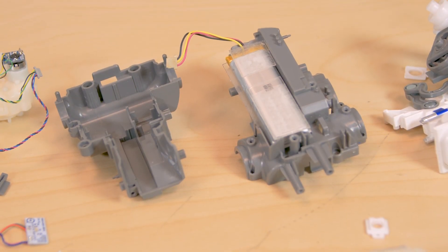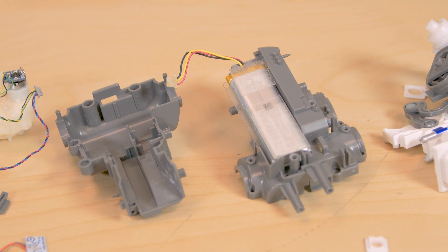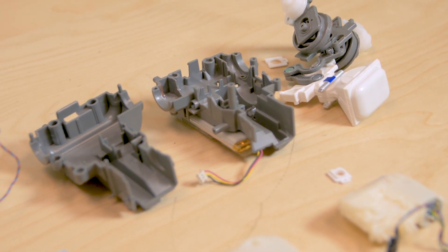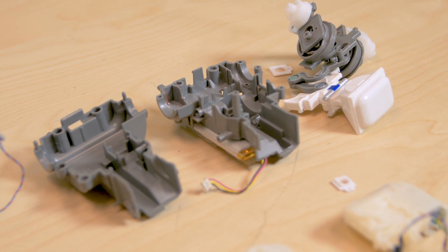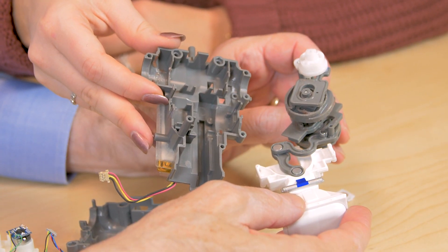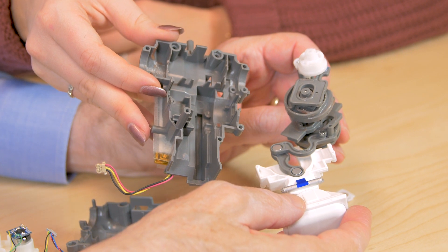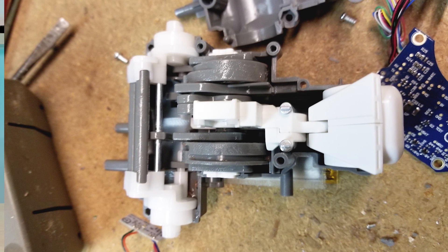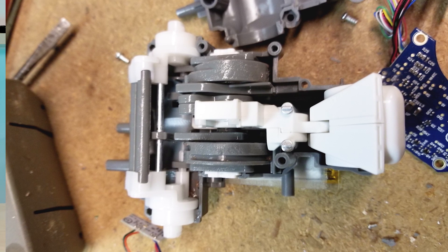With the circuit boards moved from R2's plastic frame, we are getting down to the robot's main chassis. The chassis consists of two pieces fastened together with screws. Removing them gives us a clear view of R2's foot, which sits on a lever arm that moves via cam action when the servo motor rotates the arms into position to let R2 move around. And that's finally it for R2's mechanics.